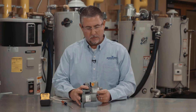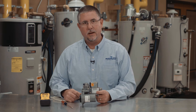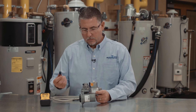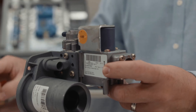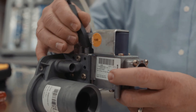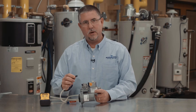The one closest — where my finger is pointing — closest to your gas inlet, is where your manometer is going to connect to measure your static pressure. So that's before the water heater comes on. With a flat blade screwdriver, we're going to slightly open this valve — it's a little needle valve — just open it enough so the gas pressure can flow. Manometer tubing is going to then go right over top of that tower, and you're going to get a static pressure reading.